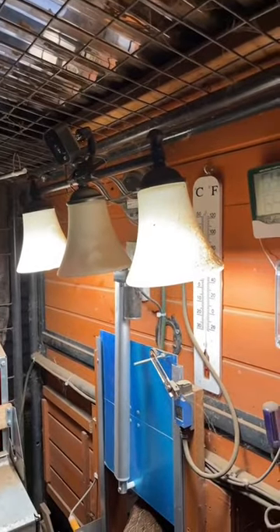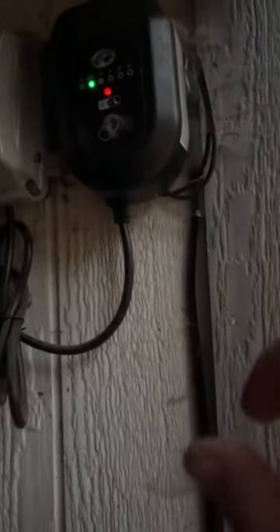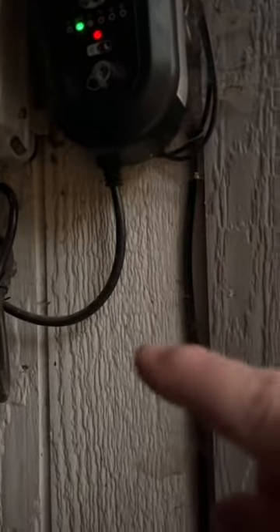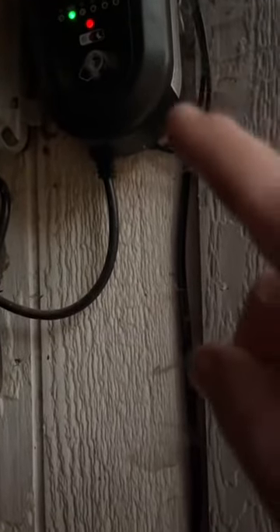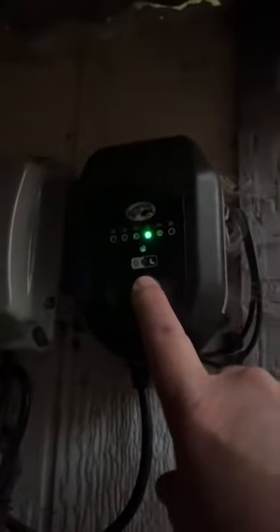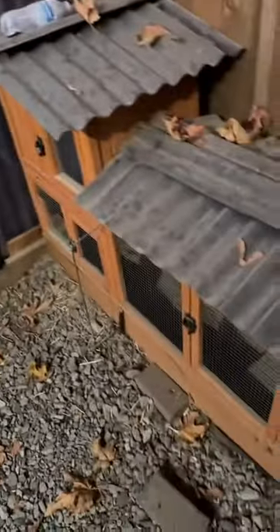With that one, there is the override right there. On this one I'm going to inline a timer switch like that one, so this will always be on dusk to dawn, and then the timer off of this one will turn the lights on in the morning and off at night, and then the photo cell will do the work for itself. That's all I do to turn this one off and they're in bed. I hope that answers your question — stay safe, have a wonderful day.